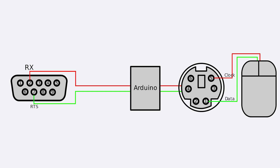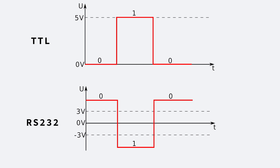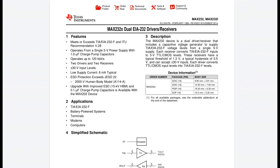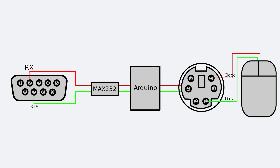This translation can be easily done using an Arduino. However, there is another problem: the PS/2 mouse protocol uses so-called TTL logic, which means zero volts is a logical zero and five volts is a logical one. TTL logic is what Arduino uses as well. But a serial port — also called RS-232 — uses different voltage levels: any voltage below minus three volts is a logical one, and a voltage above plus three volts is a logical zero. So it is not possible to connect Arduino output directly to the serial port. We need another translator to convert TTL voltage levels to RS-232 levels, and this conversion can be done by the IC MAX232, which is widely used for TTL-to-RS232 signal conversion. With a couple of additional capacitors, it will do the job here as well.